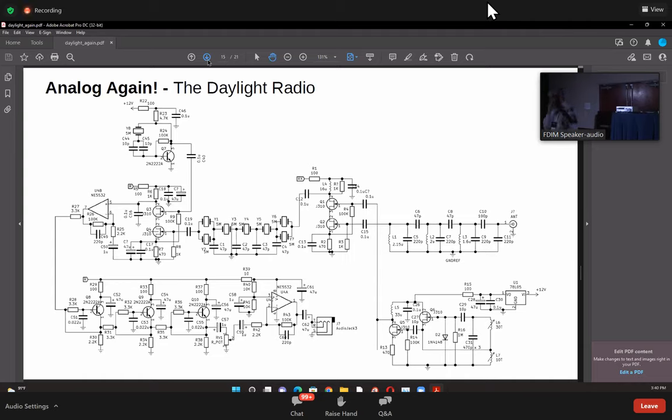This was discovered by Allison, who recommended using 2N2222As in place of 2N3904s as your drivers. They have much better current and much better distortion capabilities. They cost just about the same. So that's what is done here.